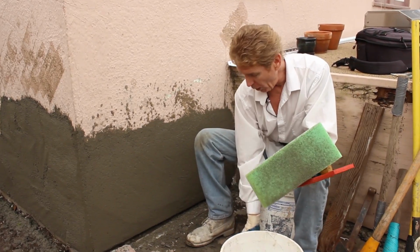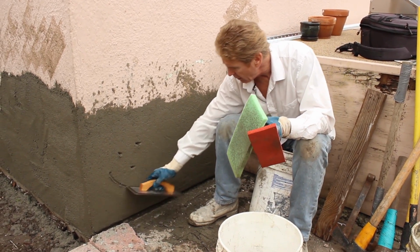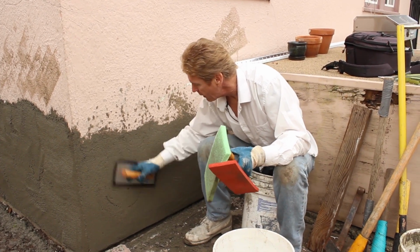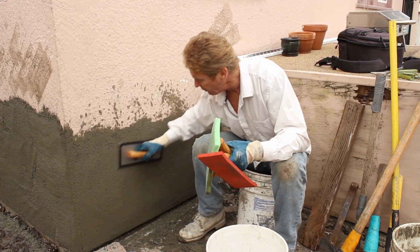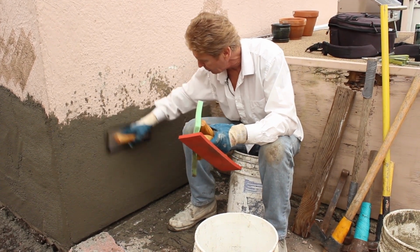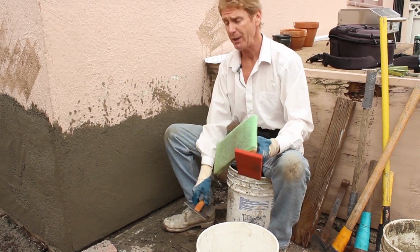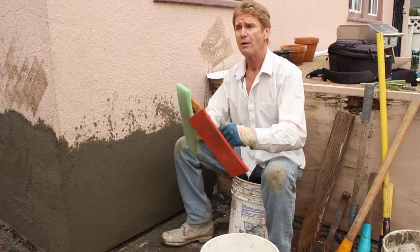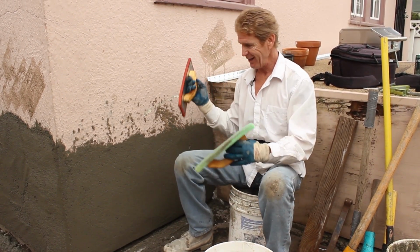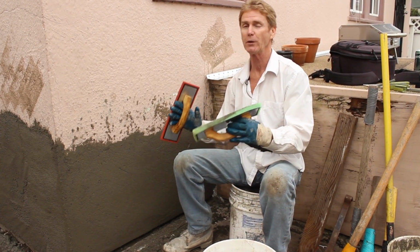We took a wall here. It's kind of wet, guys. All right, let's fix that. What I wanted to show you is the difference. Usually, guys, when you do this, homeowners, allow it to set another 15-20 minutes. It depends on the weather. Right now it's cold, like 50 degrees. So anyway, I'm trying to prove a point here. Because it's so wet, it'll pull out a little bit and make it a little sandier than when it's perfectly ready.